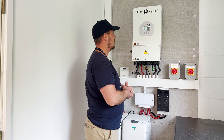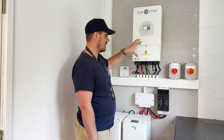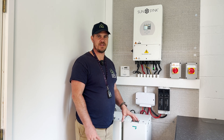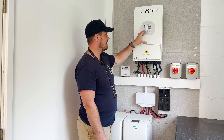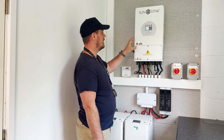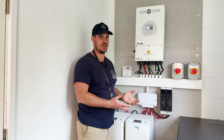If you do have an alarm light and it's come back on after the reset, and you were doing the reset to try to clear the alarm — if the alarm light hasn't cleared, the most common problem we see is the battery voltage dropping below what they call SOC, which is state of charge. This especially happens over the winter — the voltage drops below the SOC threshold and the inverter can't recognize the battery anymore because it's below the threshold of its identification. What we would do in that scenario is force charge the batteries to bring them up above the SOC with a DC bench charger.